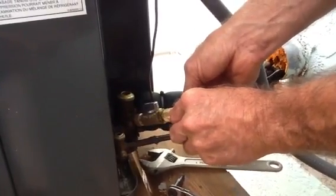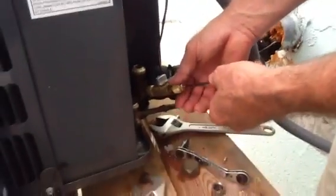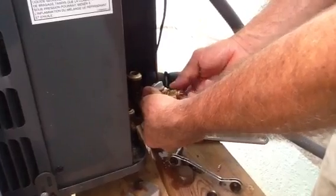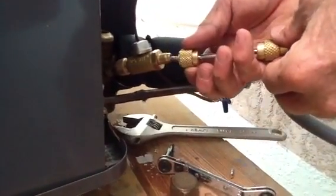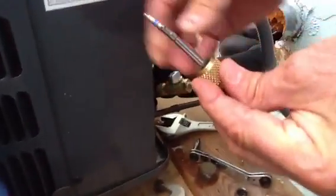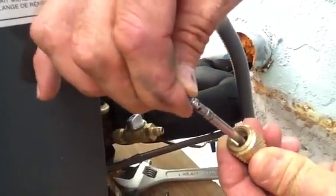I think I've got it. I'm going to let it out very gently. I'm going to shut my ball valve, because if you don't shut your valve and you take this off, all the refrigerant is going to come out. Voila — I got it. See how this tool captured the side of this thing? It fits right in there perfectly. So now I'm going to put the new one back in the same way.